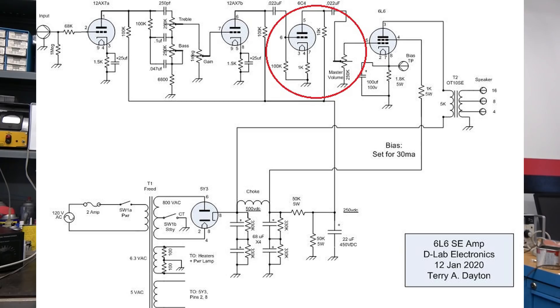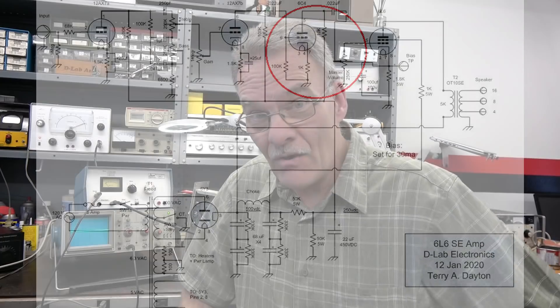Now we need to play with the wave shaping. Luckily I've got some brainiacs I work with — two EE engineers who are loving the repurposed project. I was drawing sketches and showing them what was going on with the waveform, and one guy said it looks like your power supply can supply the current but it doesn't like it when the current comes back. That was an eye-opener. So it could be an issue with the filter caps or with how it's biased. In part five we're going to play with bias, and if needed I'll install a negative bias circuit just like Fender did to see if that affects the waveform. Should be really cool — we'll see you in the next part.